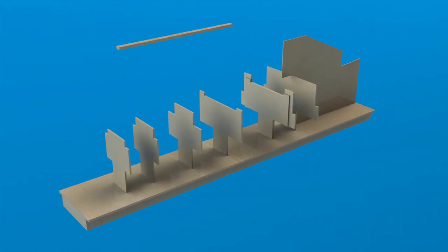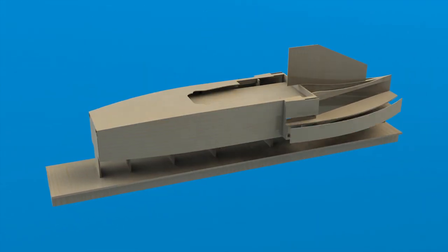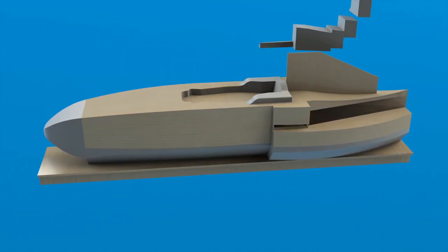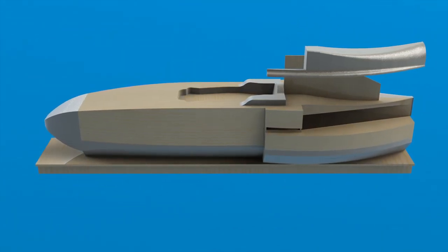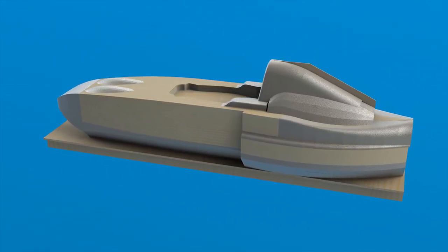Once the design was ready I started to draw the plug itself. I started with the wood and used a similar technique to one which boat builders use — with bulkheads supporting an outer wooden skin which is conformed in shape to those bulkheads. Any large flat surfaces would be built this way. I left gaps in the plug where more complicated curves or shapes existed, then drew in these pieces out of foam building blocks, cutting them to create the required shape.